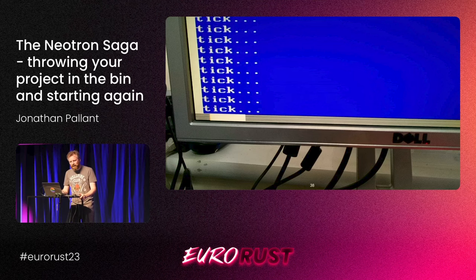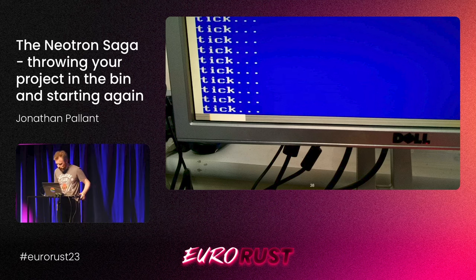New operating system, new start — we're going to need some new hardware. Design some things, throw all of the features onto the board. I even have a little go at doing some laser cutting. I've ripped out the video renderer, put it in the BIOS, and started writing an operating system. The only thing the operating system can do is print the word 'tick' once per second, but it's going. But there are weird glitches — every other scan line has gone black, but only at the bottom of the screen. To this day I do not know how this is possible on this hardware.